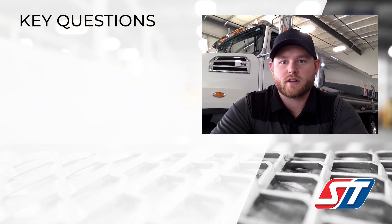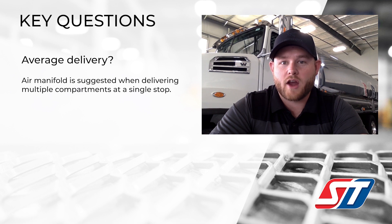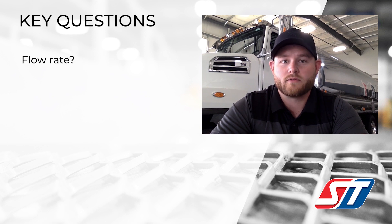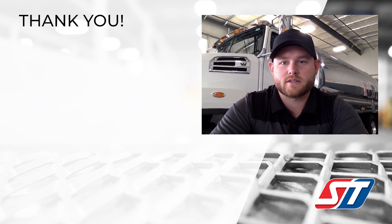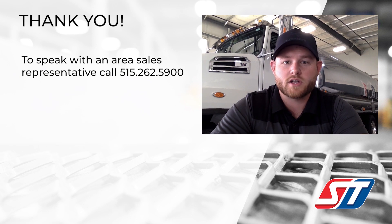When planning your next tank truck, think about the two key questions our sales team will ask to validate your choice. First, how many gallons is the average delivery for this unit's operational route? We will suggest an air manifold if you are commonly delivering the contents of multiple product compartments at a single stop, due to the ease of switching compartments and the efficiency gains when delivering in the thousands of gallons. Second, and most importantly, what flow rate range does this truck need to operate at? At Seneca Tank we will likely present air manifold options if you need to offload products above 90 gallons per minute. To achieve the lowest delivered cost per gallon, we want to avoid operating at the limits of a system and instead operate at a comfortable level for all components. Thanks for watching — feel free to call our sales team anytime to discuss systems that will be safe, efficient, and profitable for your business.